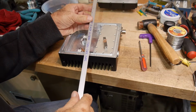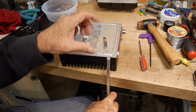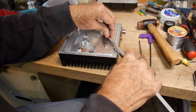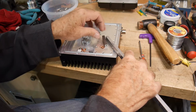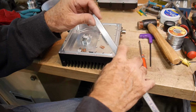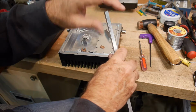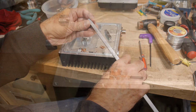Okay, I found a piece of 6061 aluminum, and it's about the right size here. So we'll have enough to balance our little part on to put a screw in there, and it certainly meets the height requirement. So put this in the mill, and we'll mill it down to the correct height. Put some holes in it, slot it or cut it in half. So we'll make two identical ones. So I'll mill it and everything first, and then I'll cut it in half as a secondary operation.